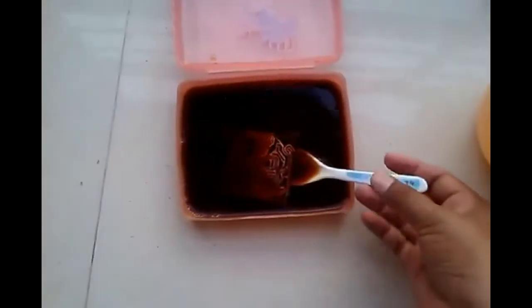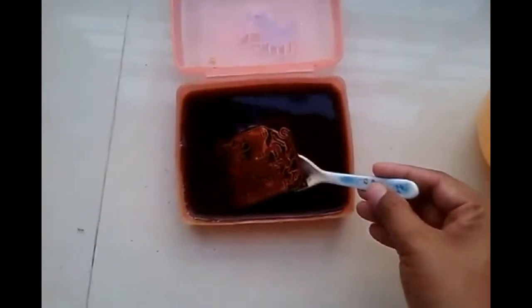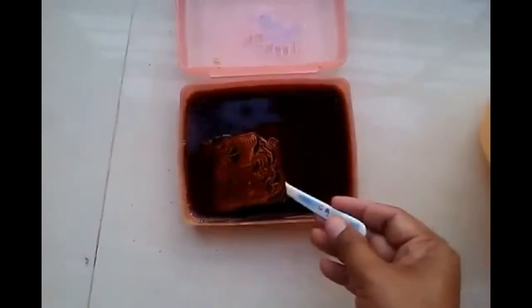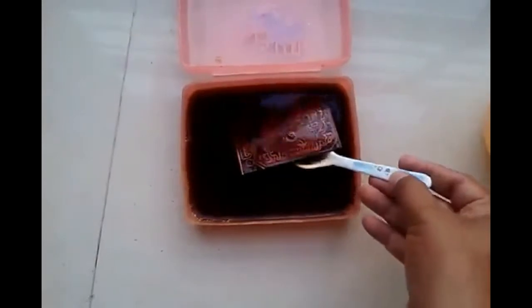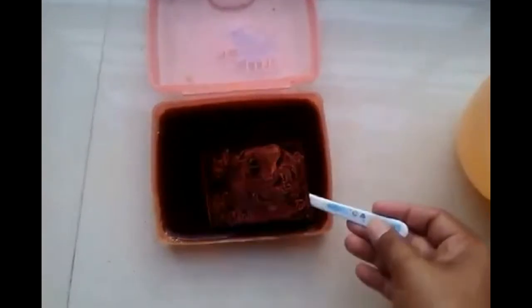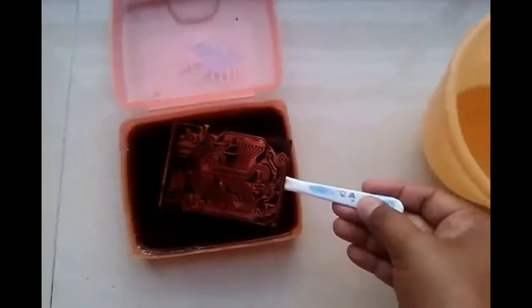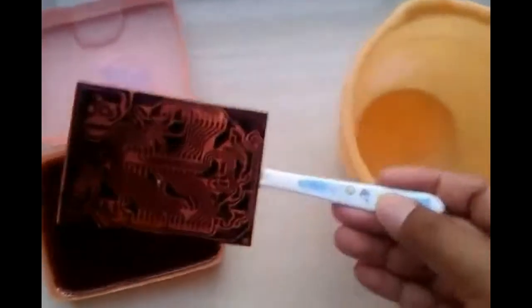After five minutes we check — it will still take a few more minutes to complete. We are not to use our finger or hand to lift this board out of the chemical because it is harmful to skin. Use a plastic spoon or glass rod. Now it looks like the process is complete, and we'll take the PCB out of the ferric chloride solution.